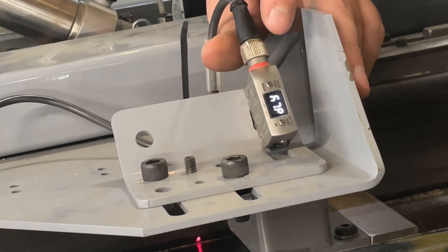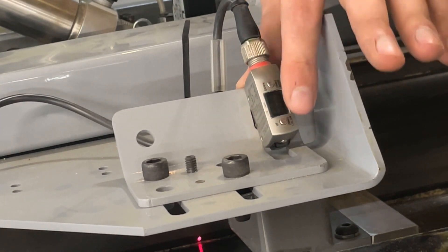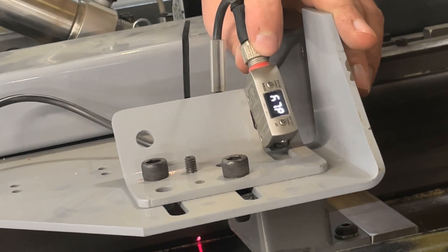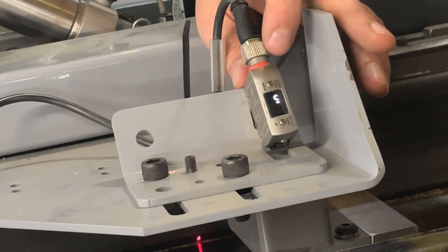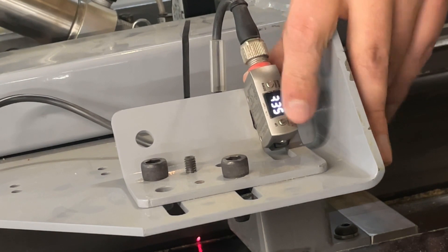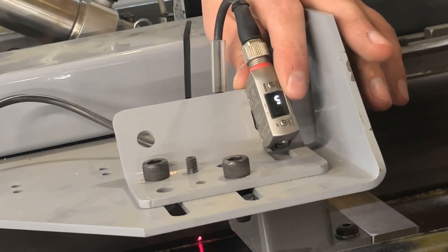The delay setting should be off. The other settings are on-delay, off-delay, and SHT (one shot) — but you want it to say OFF. Hit down again to advance past the delay value setting. Then we have external input — that's the IN setting. It should be set to off by default. The other potential settings are set, LOF, and ADJ for adjust. We want it to be off, so once it says off, hit down to return to the IN setting, then press down again to get to the next setting.